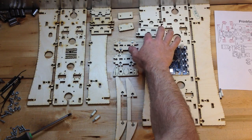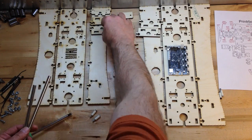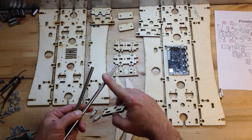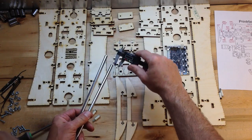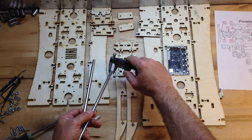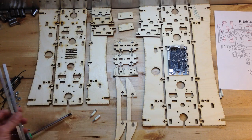The 12mm rods are a lot beefier — you can see they're bigger around. Concerning the rods: if you're building one of these yourself, these files are going to get posted online. If you have a laser cutter and you're going to cut these yourself, keep in mind that the rods you use should be machined linear rail. If you go to Lowe's and try to source these, it's just not going to work — you want exactly 8mm. By my caliper reading, these measure 7.93mm, so just a little shy, but they're 8mm rods.